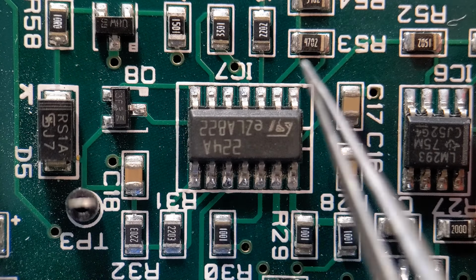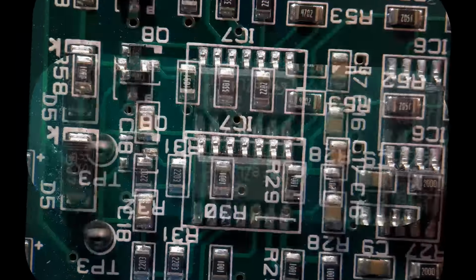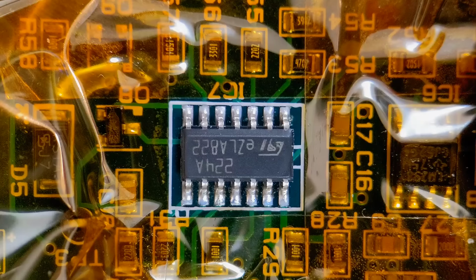So what I'll do quickly off video, get this taped up. I'm using 3M Kapton tape, so it's a branded tape. So like I say, I'll get it taped up and then we'll get it removed and see the results. Right, so as you can see off camera, I've quickly covered the surrounding components with the Kapton tape. I also added some rework flux just along both sides of the joints just to aid the flow of the solder. So let's bring the hot air gun in.